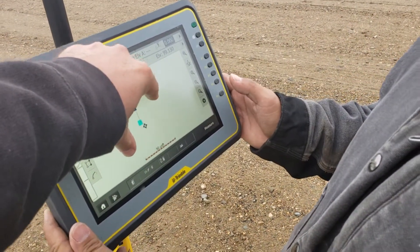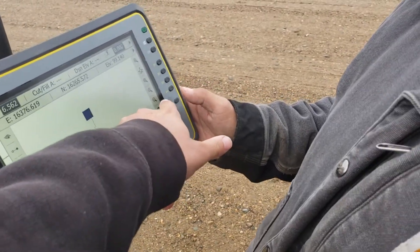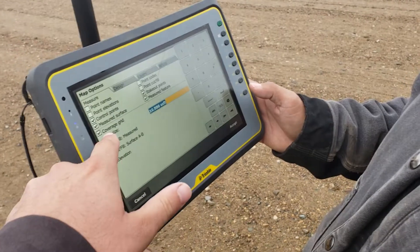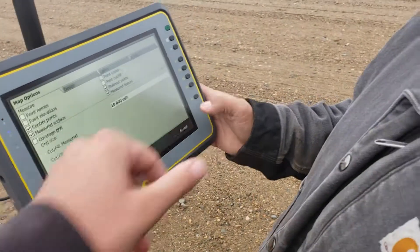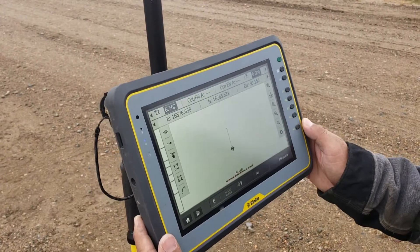At that point we've got something to square off of and something to base our distance off of. Hit the same icon, then hit accept at the bottom right — that will end your line, so it's no longer shooting. It's saved. These squares are coverage grids. To shut those off, you can go there, turn off the coverage grid, and hit accept. There we've got our line. The top of the screen is north, so that's why it's showing us like that.